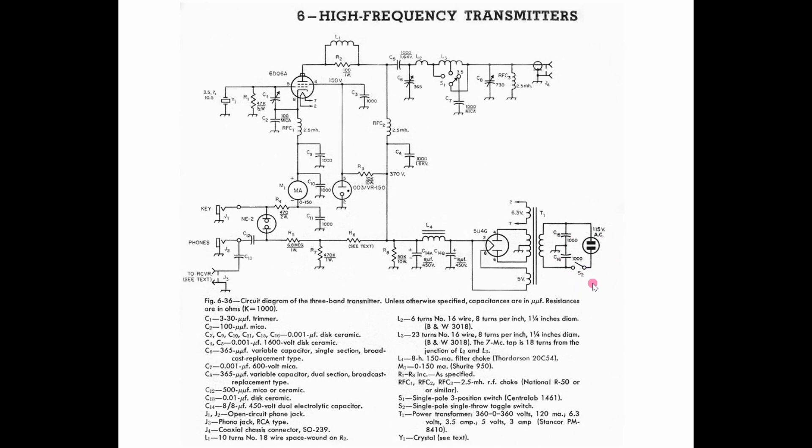Let's look for the fuse — does anybody see a fuse? I don't see a fuse. This is an error in the schematic. We should be adding a fuse, and it should be in line before these capacitors — it could be placed here or before the switch. We can always find fault with any schematic; there's always room for improvements.